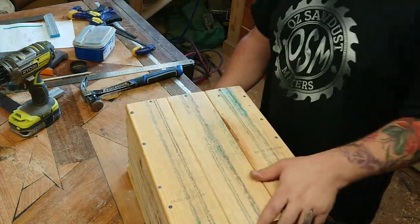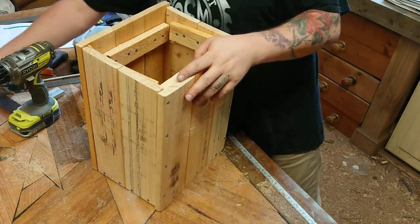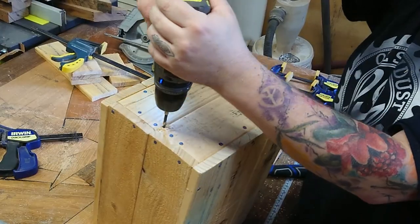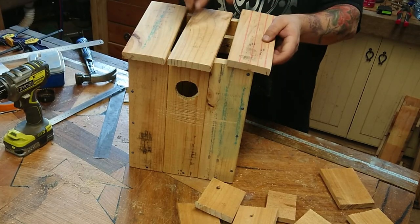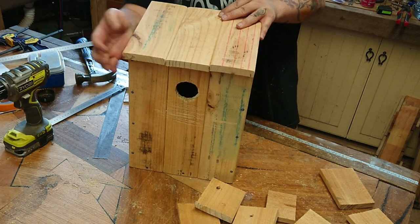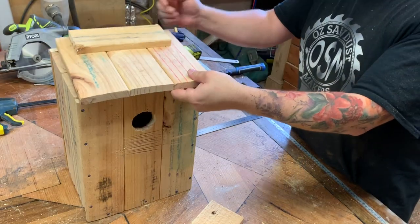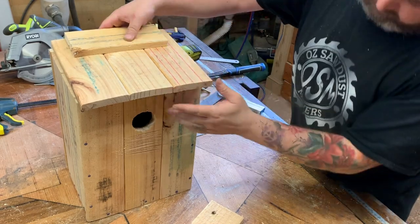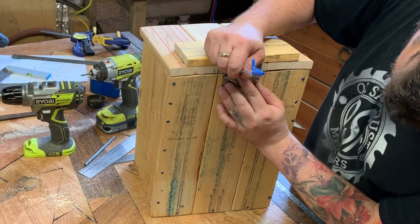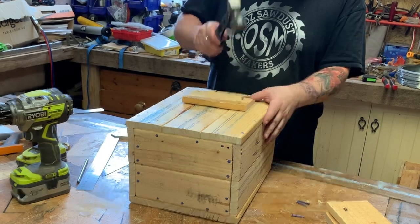And we've got a box — looking all right. Now we need a lid. There are some quick drainage holes. For the lid we've got those three pieces across. I've got some bracing on the bottom and some bracing along the top — it's made it actually quite solid. Stainless steel hinge is the best way to go. Just marking out, pre-drill those holes, and then a little bit on the back to rest it against the tree.